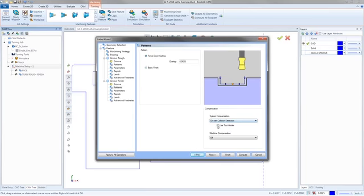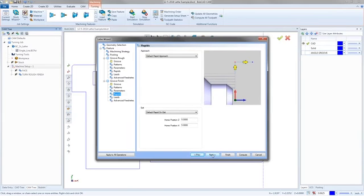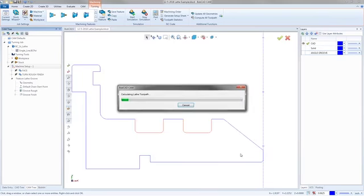Now, with collision detection, I'm going to use the tool holder. No change for the parameters. We're doing a finish pass now. There's no more stock that we have to save. And pretty much just next my way through until I can hit compute. Grooves don't take too crazy long to calculate. The difference is we have 2 grooves, so that's why you're seeing this box pop up a couple more times. You'll see it one more time after this.